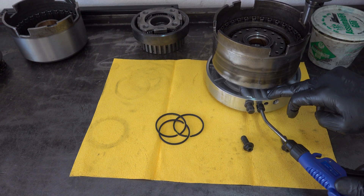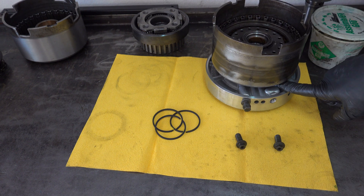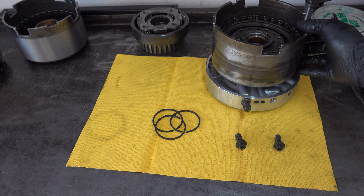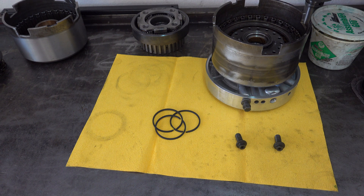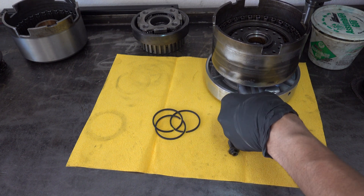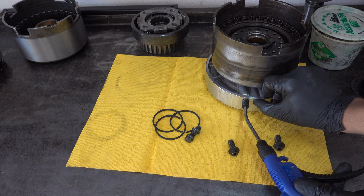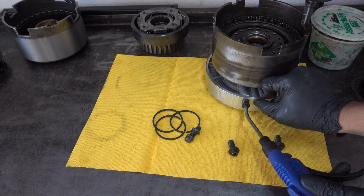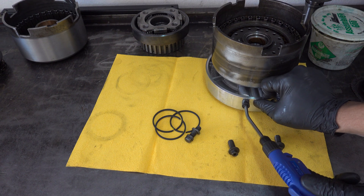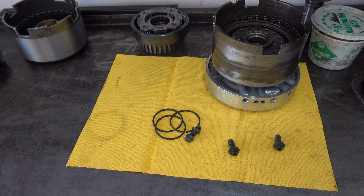Nice, good apply. Now there's a bleed system in here — you have a bleeder ball capsule in the drum and also one in the piston. That's the hissing sound you're hearing coming from the underside of the drum. In this situation we're not going to dual feed, so we'll just test high reverse. You're going to have a little bit of air coming out of your direct as well, because reverse is dually fed. You have fluid going into both chambers on either side of that apply piston, and that's what you want for direct when you shift from two to three in a higher performance application.